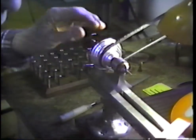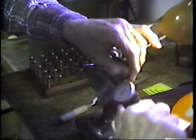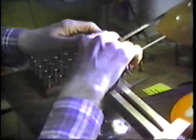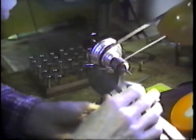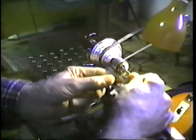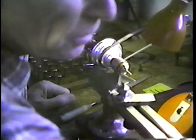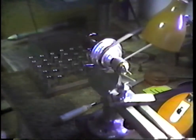All right, we'll slide this back into the chuck. We'll give it about a half inch of overhang here. We don't want too much overhang, because as we cut this smaller, it will flex more out at this end. All right, set up our tool height, and we'll get a tool bit. We better place a little oil on this hard projection and see what we can do with it. Let's try the sharpness of this one. I think that will do all right.